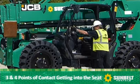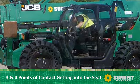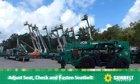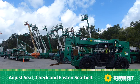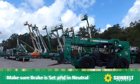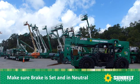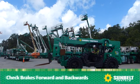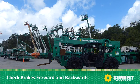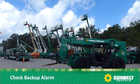Three and four points of contact getting on the forklift and into the seat. Adjust the seat, check and fasten your seatbelt. Before starting, make sure the brake is set and the gear shifter is in neutral. Check the brakes, forwards and backwards. Check and make sure the backup alarm is working.